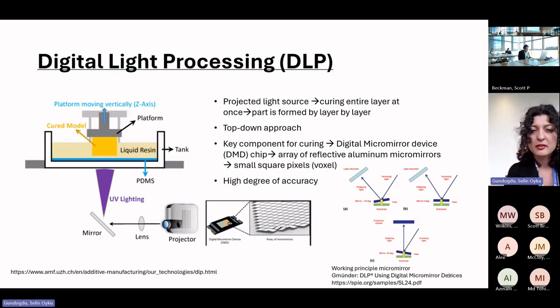First, I'll briefly explain digital light processing. DLP is a printer with a high degree of accuracy. It has a digital projector at the bottom of the tank and a transparent film between the tank and the projector. It flashes an image of a layer onto this thin film, cures that layer, and the cured layer sticks to the build platform. The build platform moves up and uncured resin flows into the depleted region, then another layer is cured.